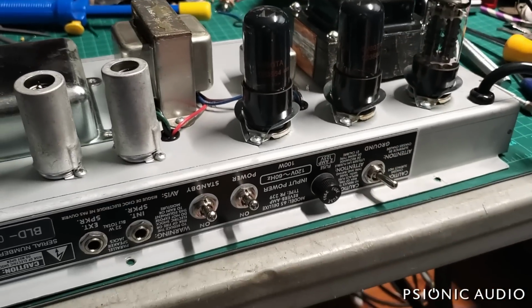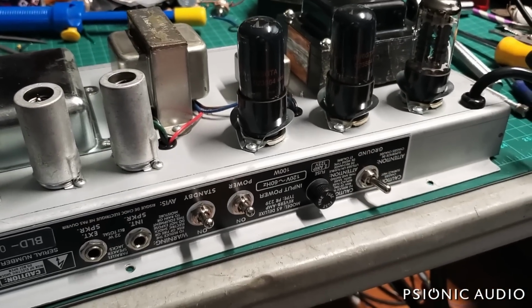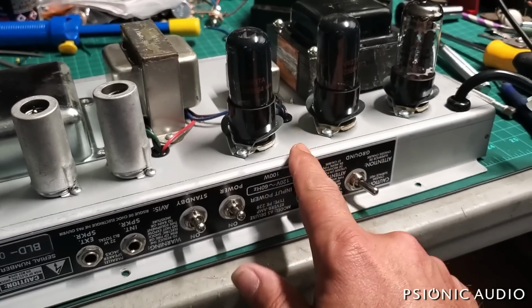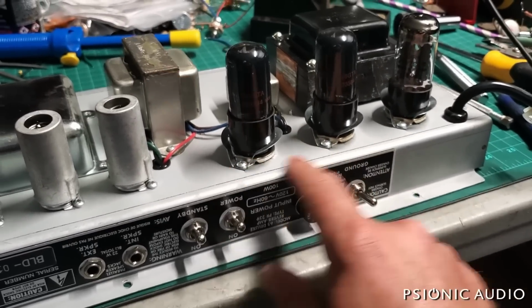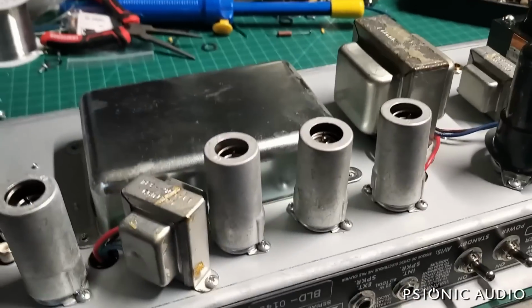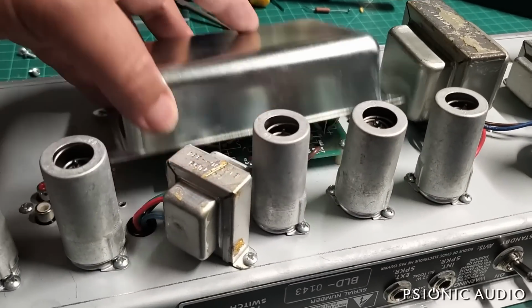Seriously, the wall circuit breakers in my house are 10 and 15 amp circuits. A 25 amp fuse does nothing, which means that things can burn terribly inside an amp long before your circuit breaker trips in the house. Let's look at the next likely cause.